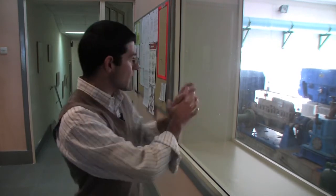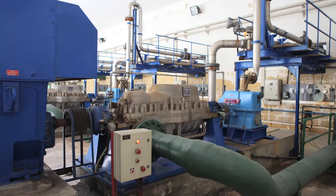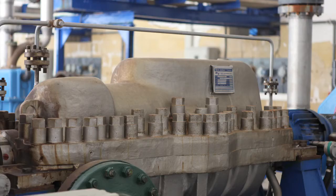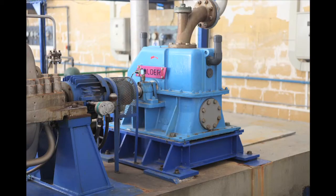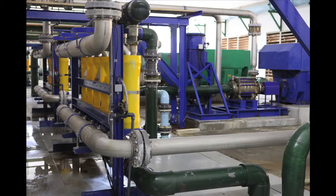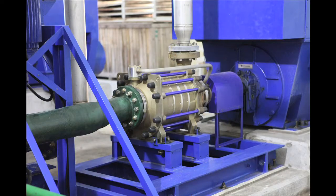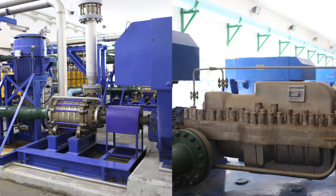The major factor of energy consumption is the high-pressure pump, so it makes sense to try and recover as much energy as possible from the still highly pressurized waste water. Traditionally, this has been done via Pelton wheels, but recently half of the plant has been upgraded with pressure exchangers. These purely mechanical devices use the outgoing waste water to directly pressurize the incoming seawater, making them much more efficient — an effect that's easy to see when you compare the pumps on both sides.